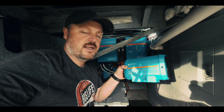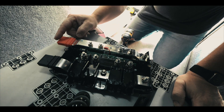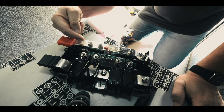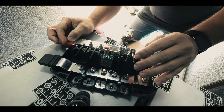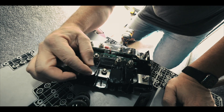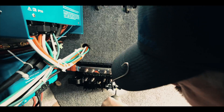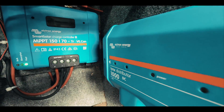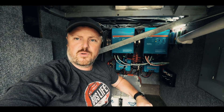To give a walkthrough of what we have here: we have our positive post here and these lugs, which will have fuses that bridge these gaps. When you lift these up, you've got all the negative posts underneath. If you're using a large gauge wire, you will want to take these spacer pieces out. I got that installed — it installs very easily with just four screws. Now I'm ready to go ahead and make my 12-volt connections into it.